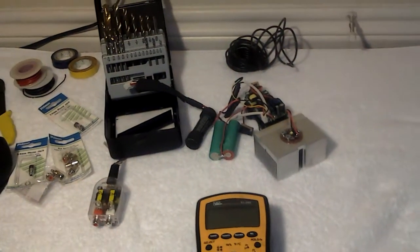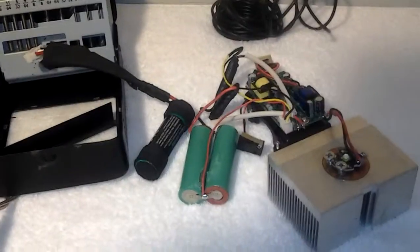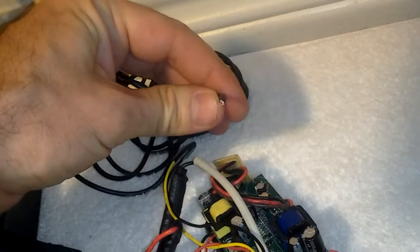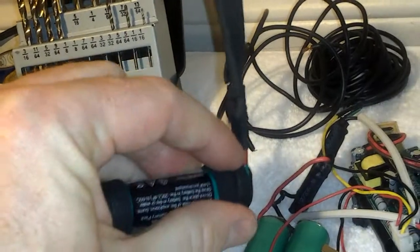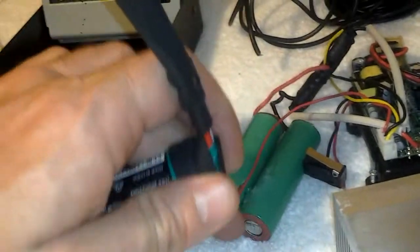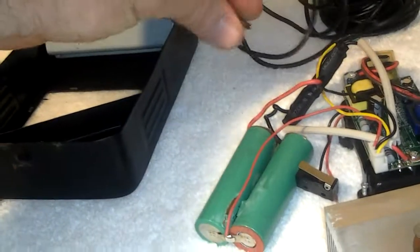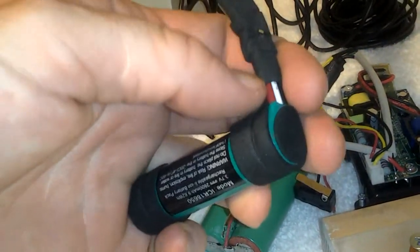And then it's basically just plug and play after that. So it would add 2 really nice features to your Onyx Studio 3, and it wouldn't affect the profile of it. You want some thicker wire, I don't even know what gauge that is, but just try to match this gauge wire. This is actually thicker than these. I'd upgrade. I'd just take this wire completely off and put 2 big fat wires right off of it, about that size, probably. But just try to get it close to this gauge, and you'll be good to go.